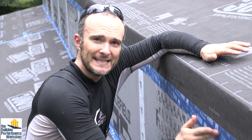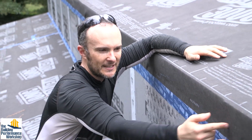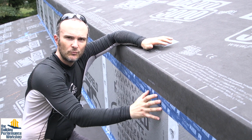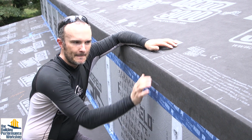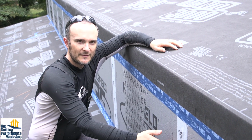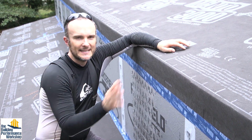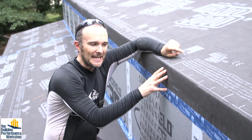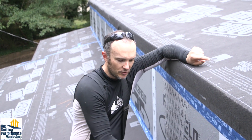I want to make sure that this seam is airtight, because just because there's a ledger here that's attached every 16 inches on center, it doesn't mean that it's going to result in an airtight layer. So I'm going to go ahead and redundantly put a layer of Vana here. I'm overlapping over the ForceField, and that's just simply for drainage. So that's the same as you would flash anything else. So anywhere we have an eave, it's this same exact detail where we go over the edge by 6 inches, I tape it, we make sure that all that is there.